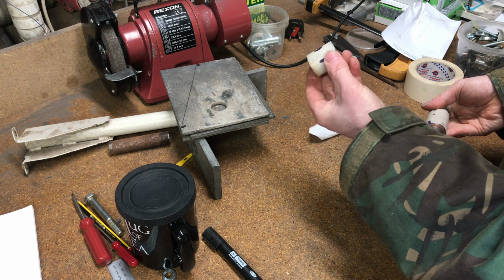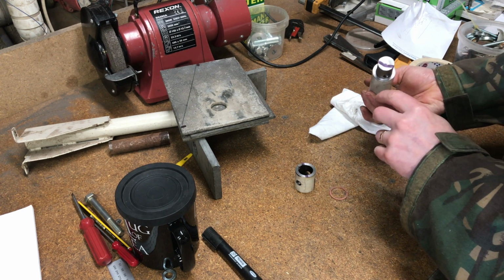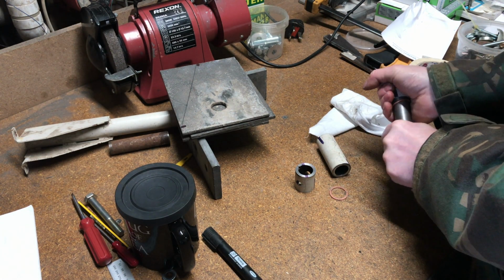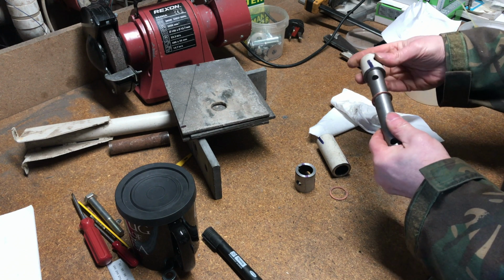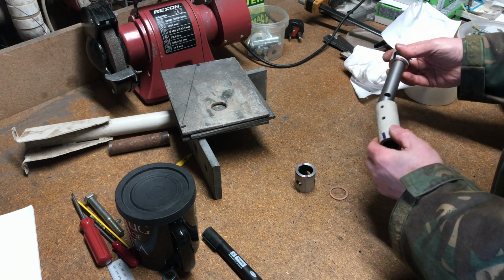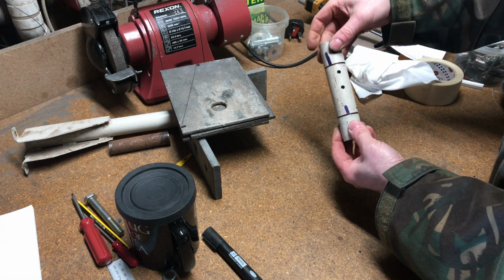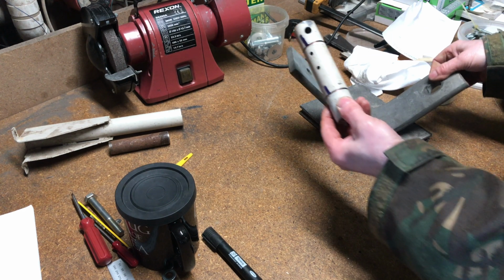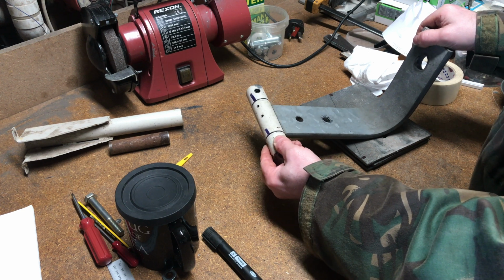Yeah, there's a steel tubing. I'd cut it and turn it down on the lathe just to make it nice and square on the ends. Likewise with this, turned it down, tidied it up. Is this way? Yep, that's going to come out. This had to be turned down to about 23mm to suit the inside diameter of the outer pipe, but that's fairly easy. I've got a little lathe, bit old, but it works. So that's largely the basis of the pin. This will be fixed to the pedestal, the top and bottom, and that top piece will be allowed to rotate. That piece being welded to the section I got here of steel. So we'll get that cleaned up, and I think it's time to do a spot of welding.